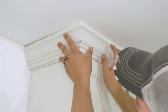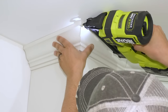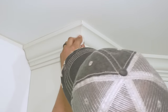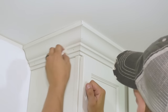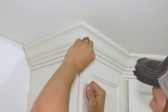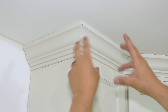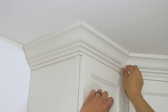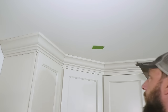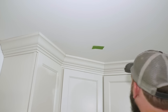So what I'm going to do is glue and nail this 45 together first and hope that it stays together while I maneuver this around. Wipe off this glue. It's going to be hard to get this stuff perfect — it'll be easier if you don't have a ceiling to go to. A lot of people will just leave a gap. And if that's the case you cut them at a perfect 45 like I showed you on the saw and just run it along — it's much easier than if you're attaching to a ceiling. And as a side note, this is why I didn't cut my recessed lights, because I think I'm too close to this crown. Yeah, that's only nine inches to the center, so I'm going to have to move those out. That's why I didn't cut them — because I figured I'd be too close.